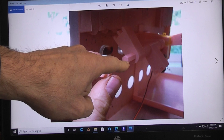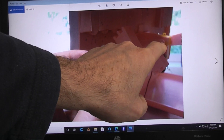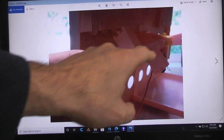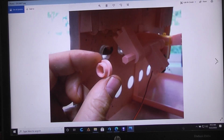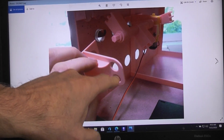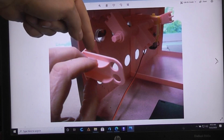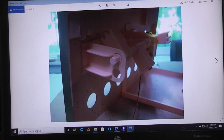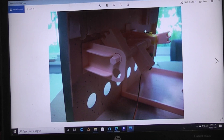So this is the next part — there's a hex shaft that pushes right into the end of the motor cam that was already on there. None of this stuff has to be glued. The cams slide on the shaft as well and will space themselves all the way on, and then there's a bushing that you put on the end of the last one. You can do the same thing on the other side. This mount has double holes so it can go to the other side and flip over — we're going to use the top hole on whichever side you're on. Put your glue on there, line that on, shove it up to the bushing, just like this. Everything on this side is going to be held in place for striking correctly. It's a hex shaft with six flippers, so make sure everything is as close to being opposite as you can — it's supposed to look very random.